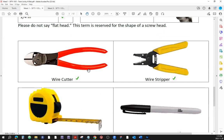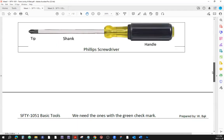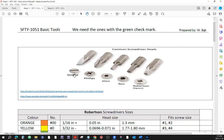I just wanted to touch on the subject of using the proper screwdriver heads with the proper footprints. It is important, right? You're either going to damage the screwdriver head, or you're going to warp the footprint. You're going to make the screw useless. Plus, you're not going to be able to make a proper connection if you mismatch those. Guys, girls, it's important, right?